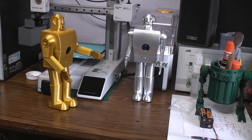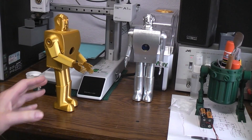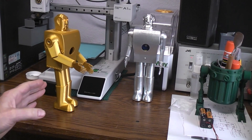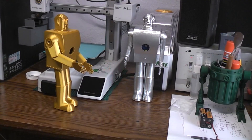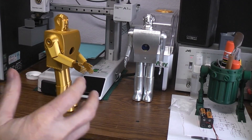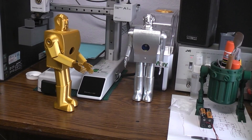I haven't changed it — that's the way the chip is programmed. Now there are some other differences as well. What I've done is I went online, typed in 'text to voice translator,' and found a free one. I downloaded two different voices telling the electro to walk and then a handful of voices telling it to stop. The reason I did more stop commands is because I want to make sure I can make it stop. I'm carefully not saying the phrase right now because I don't want to activate it with my voice, but I'm ready to go.